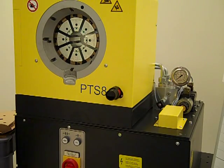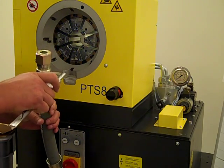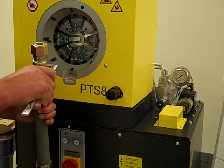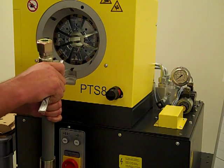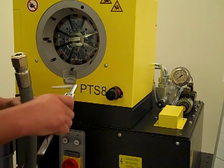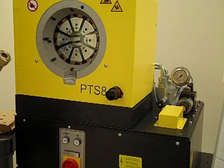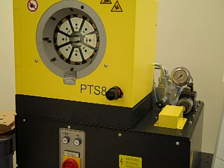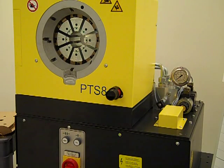Once done, an assembler can check to make sure that the crimp was done correctly by measuring the crimped coupling's OD to determine if it has been crimped to the targeted final crimp diameter. If the assembly does not look correct but the measurement does match the targeted final crimp diameter, then check that the final crimp diameter is correct — remember that it was based on measurements taken and applied to the formula or selected from a chart. If they are correct, contact the coupling manufacturer to double check the targeted final crimp diameter.